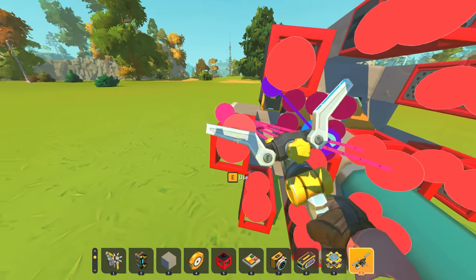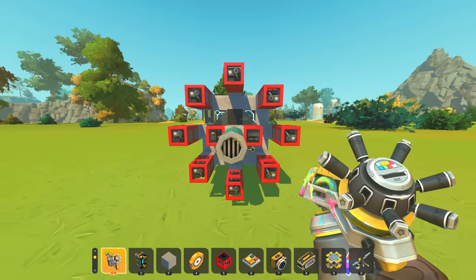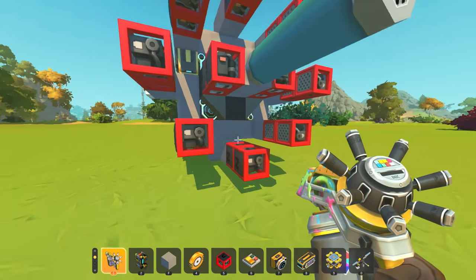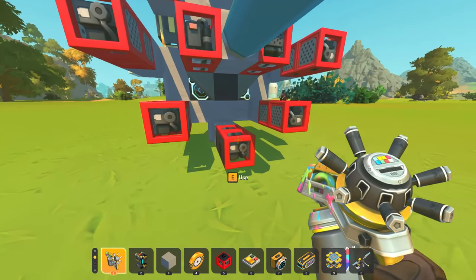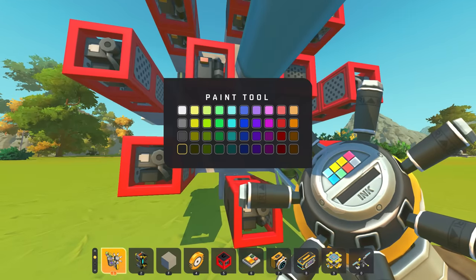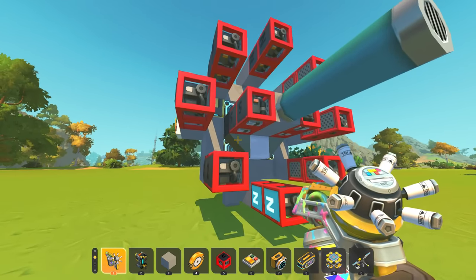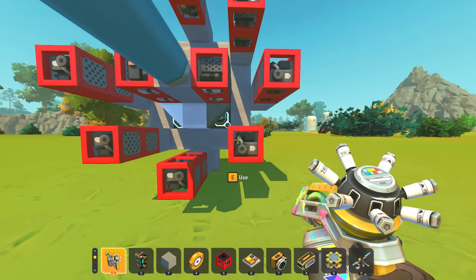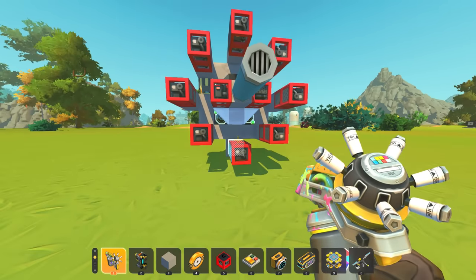We wire each sensor up into each set and color the wheel accordingly based on what sensors we want lit at what time. This bottom one, if it's on, would attract the south towards it and push away the north. So this one could be on, this one could be on as well for this moment in time because it's still pulling the south down towards it, and this one could be on because it's pushing the north away.